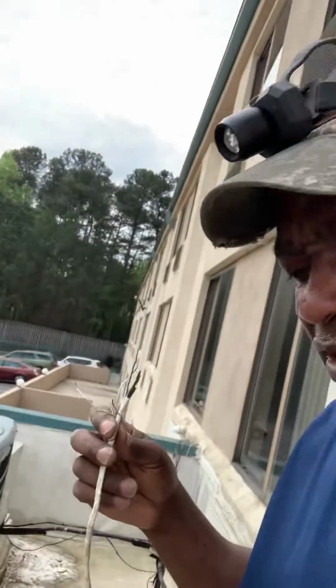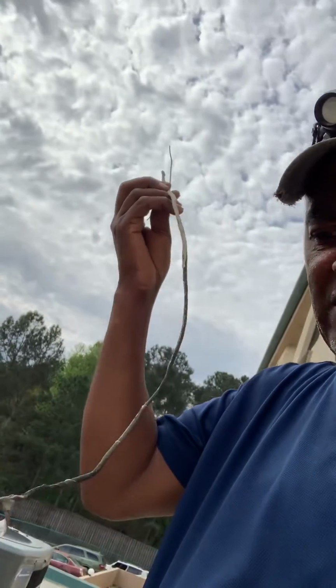They were actually touching on the inside of the insulation, causing this heat pump to run and freeze up and never cut off. So always troubleshoot your low voltage wire instead of your controls. It's not always your control that's bad. It could be anything, as simple as a wire touching on the inside of your insulation.